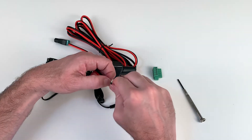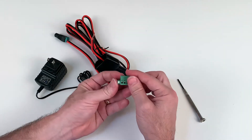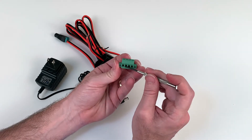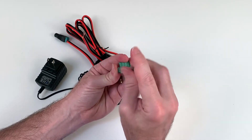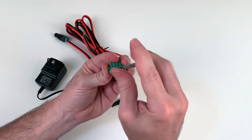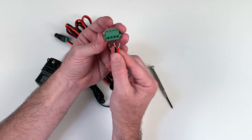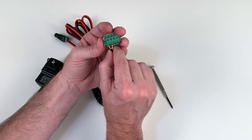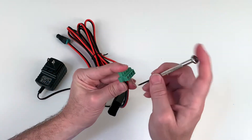The shroud will help prevent moisture or liquids from getting splashed on the terminals once installed. Another handy thing to do is give the wire ends a twist so the wires stay together. Then take the wire terminal adapter and make sure the leftmost openings are open — turn the screws counterclockwise until they're wide open. Place the red wire in the left terminal and the black wire in the right terminal, then insert the wires.